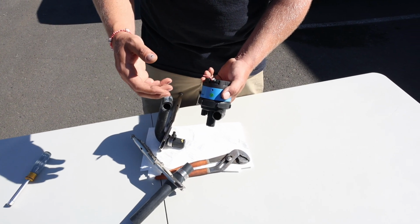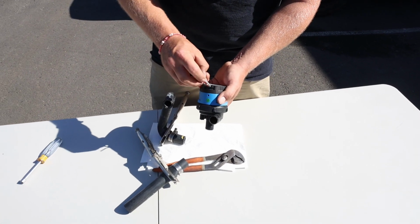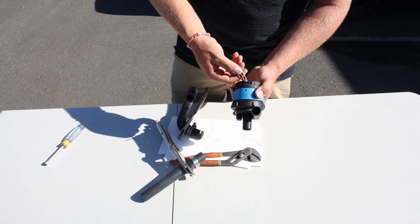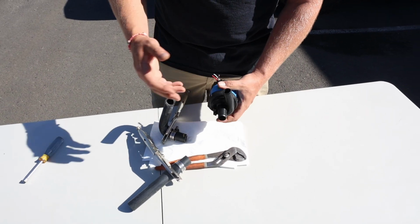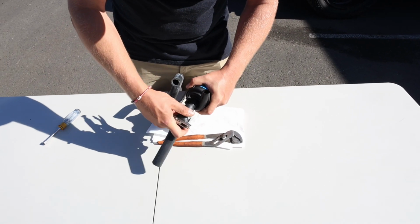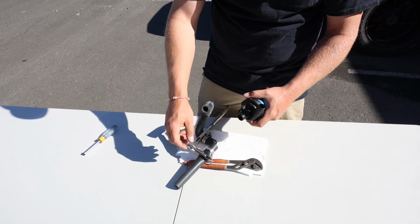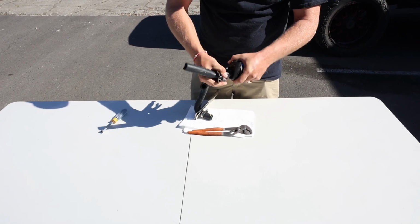Once you get an established circulation, then you can remove that white wire and put it back to the red, and that will keep the pump at its normal speed. So commonly normal would be white and red together to power, brown to ground. Then at that point, you're going to grab your new pump. Sometimes you may take a little WD-40, a little lubrication, and put it on the pump port. That way these hoses slide on nice and easy.